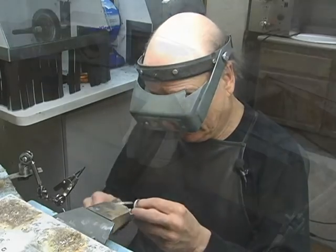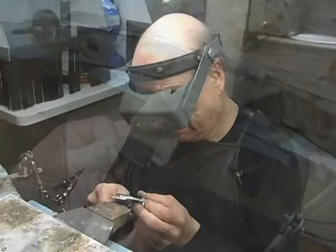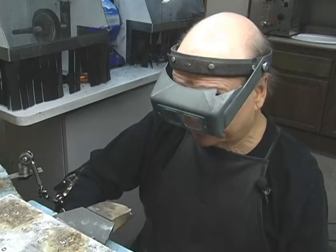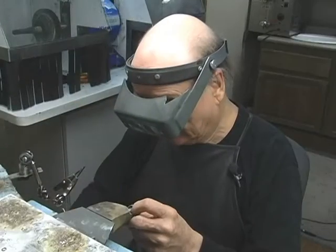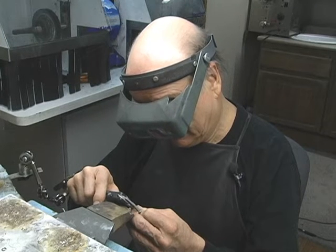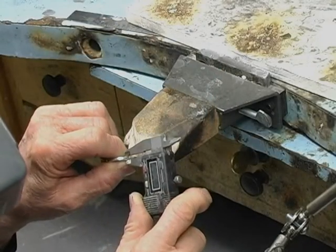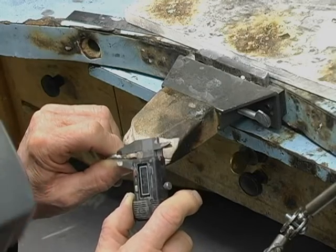So I'm going to take a thickness measurement, and it looks like it's 140. And I'm going to take a measurement on my width, 387. I'm going to make a light mark there. Check my width again. 380. It varies. So I'm going to go over here, and I want to pick a side on this shank the same width. .376, 387. So it looks like right about there.